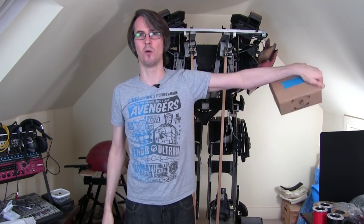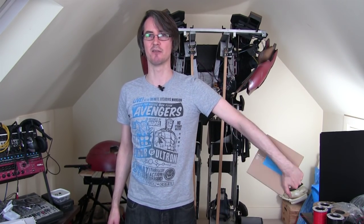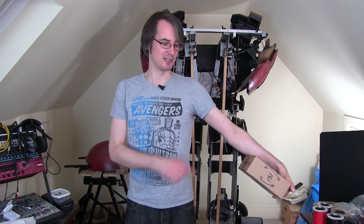So if I put my arm out, this is Y. But if I put my arm down so I vary in Z, then now this is Y, which is the same, and again it's an axis going this way in space. So that was initially very confusing, and I also found that when I moved in Y this way, I get some data out of X, even though I'm not actually rotating. And if I'm halfway between, say, 90 and 0 in Z, so about 45 degrees, and I rotate my arm, I get some data out of Y, and some out of X, and that made more sense because I'm partly rotating in X by doing this, because my arm is partly facing upwards, and I'm also partly rotating in Y.